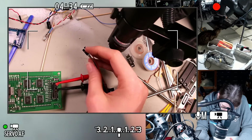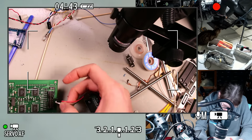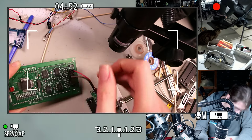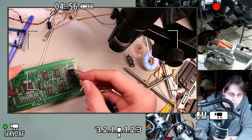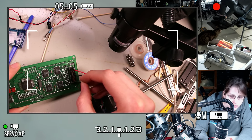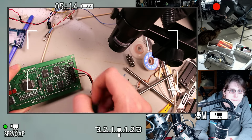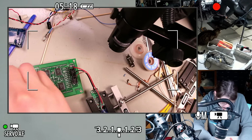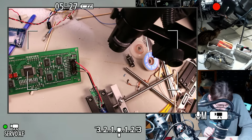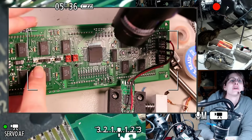So this will be mostly the same. So ground, +5 and serial. So 10 is the ground we're using, serial is 14. Okay. And I'll take this off of self-test mode. So now it should be accepting full strength RS-232 at 19,200 baud. Wow, it even goes down to 1,200, I just noticed that. 1,200 baud.